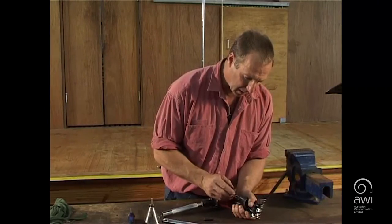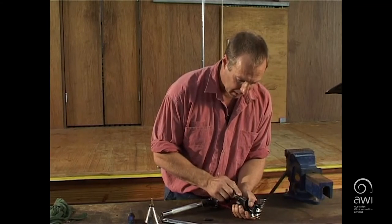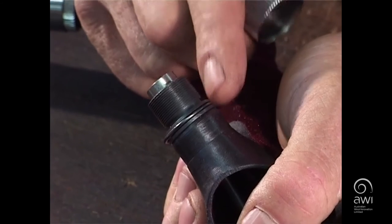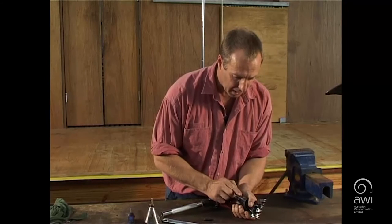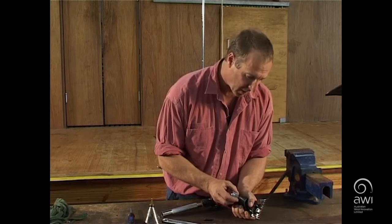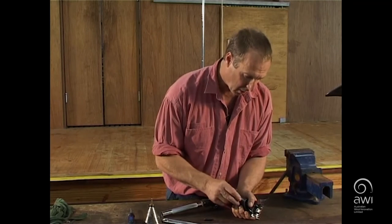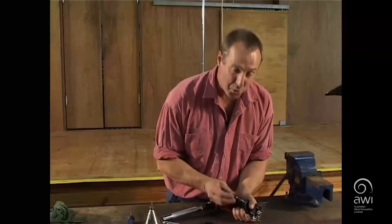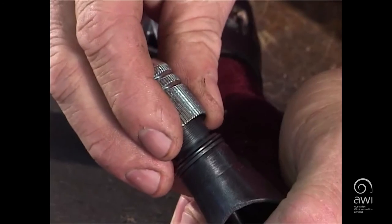Under the tension nut, we have a tension spring. And the reason why we have this tension spring is to maintain the tension on the handpiece and to stop the tension cup from unwinding, which then can cause a lock-up and serious injury. Do not remove the tension spring.